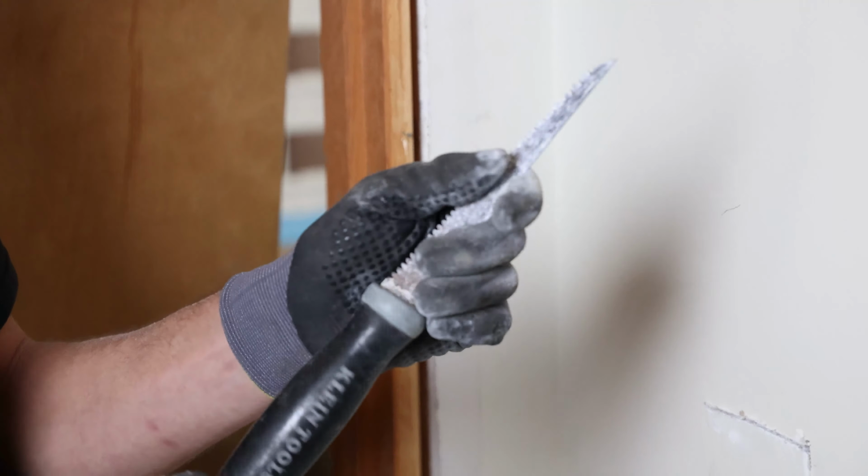I think we have a wiring path. We've got plenty of existing holes we can utilize. So, hot feed, continuing from location number one to location number two. Now from location number two to location number three. This is a 12-2, that means I'm carrying a hot, a neutral, and a ground. That's the third conductor, but that's not a current carrying conductor. So it's excluded from the count.